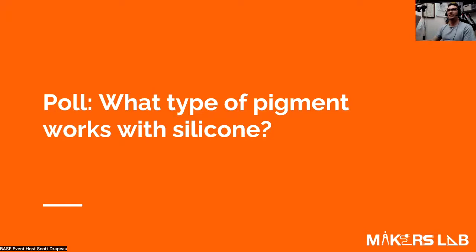Well, I got a good question in the chat here from Danica. How would you attach the ear to someone's head? Well, there are different ways you can mix silicone, in that you can make it extremely tacky or you can make it really dry. With the mock products we've implemented, as in they're not really used, they're more prototype products, we've mixed A and B differently. So instead of doing a 1-to-1 ratio, maybe we do a 2-to-1 or a 1-to-2. Experimenting with that kind of chemistry will yield sticky silicone that will remain sticky for its life.